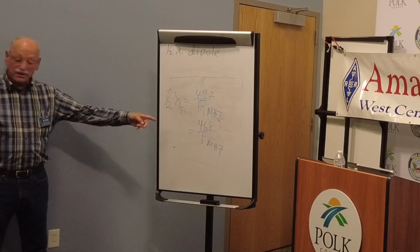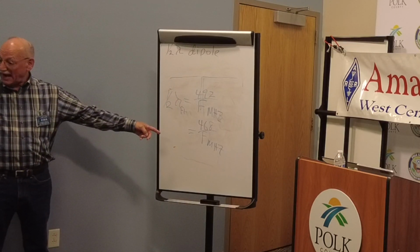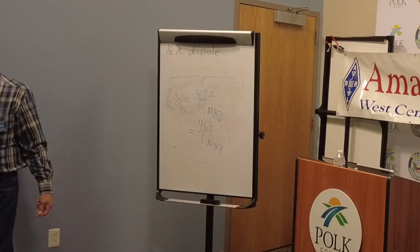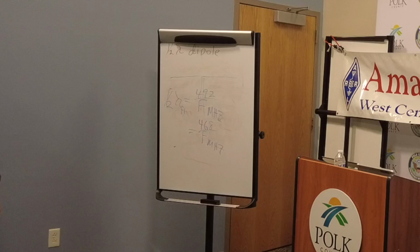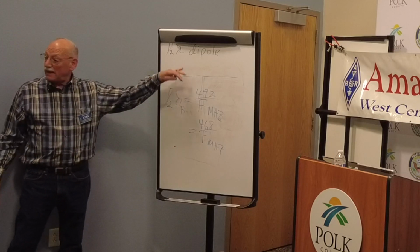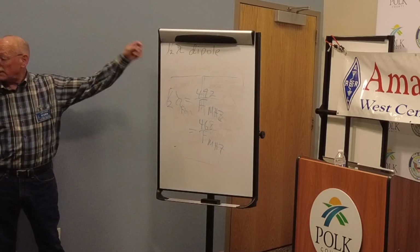Insulated wire, you got capacitance, added capacitance to it, okay? How high is it above ground? Is it a half wavelength or more above ground? Probably not, especially not at 80 meters. That's 25, mine's 25. Yeah, see, so you got coupling to the ground, so that affects the tuning.